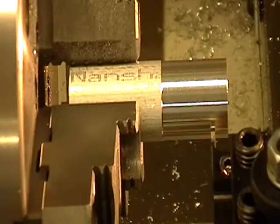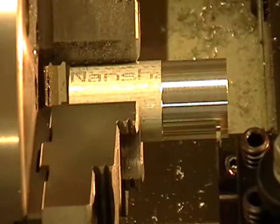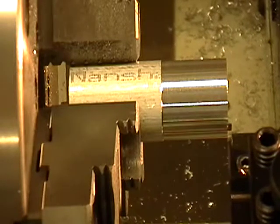I'm using a caliper, but you really should be using a micrometer. I've got point nine eighty four. So I add eight thousandths to point nine eighty four and I get point nine nine two. That's giving my X: X point nine nine two, absolute set. This is how we position X.